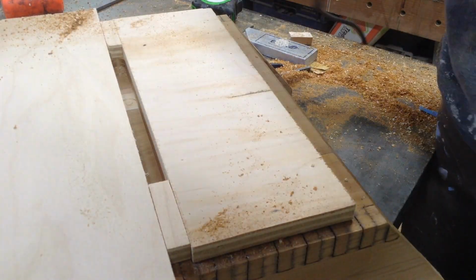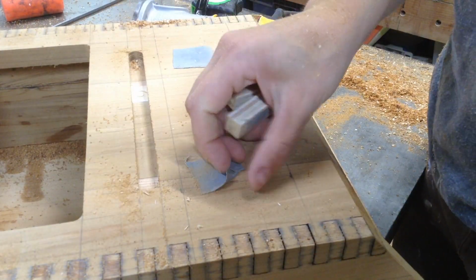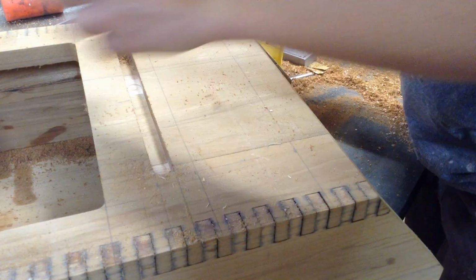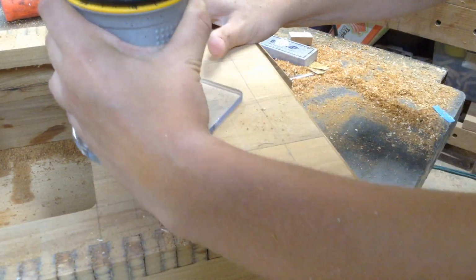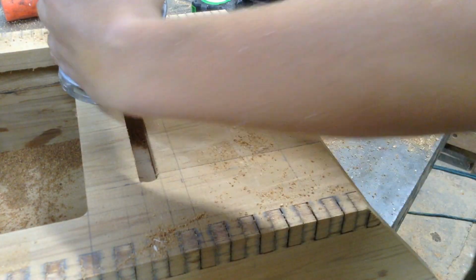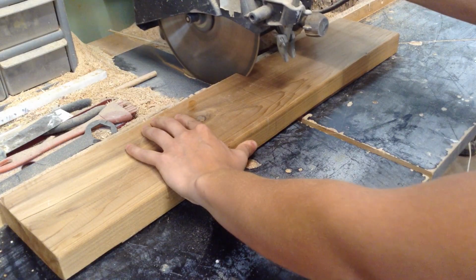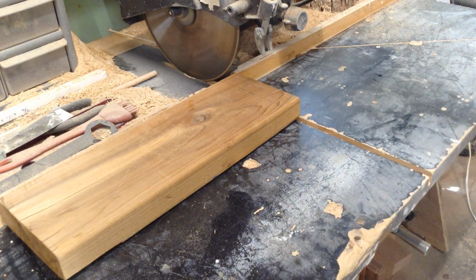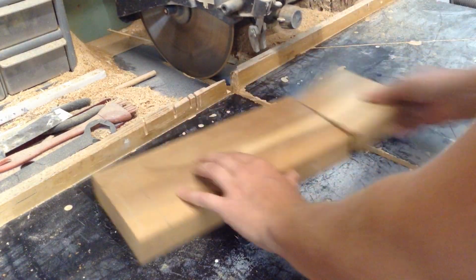You can see some of the finger joints have some hairline cracks in them, and that was more so because this cedar is a very soft lumber, so it had a fair amount of tear out on it, even using that blue tape. Before this goes to the customer, you'll see later in the video, I filled all of that with epoxy that I mixed with wood glue. They sometimes look bigger in the film than they are in real life. There were pretty tiny cracks on the side, and since it's going to be painted, that will be covered nicely.